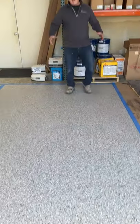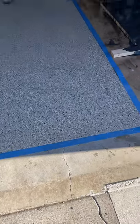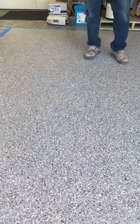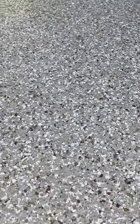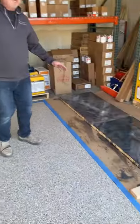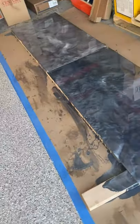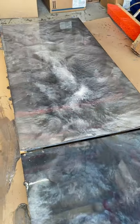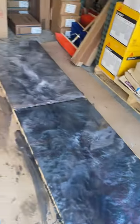In here — this is an old garage floor, their warehouse floor — we went in and profiled it and used our Trans Floor system, which is a two-part epoxy system. Here we've got the flake floor system with a polyaspartic sealer on it, giving a nice gloss and very durable finish. With that same system we're able to come over and do some really super cool metallics — Chris Becker has done an incredible job with techniques manipulating the material with air, rollers, you name it, giving a really cool effect. These are sample boards we'll leave out for display. This is not only for man caves and garage floors — it's also for countertops, and there are a lot of artsy people who can make some really cool fun stuff.